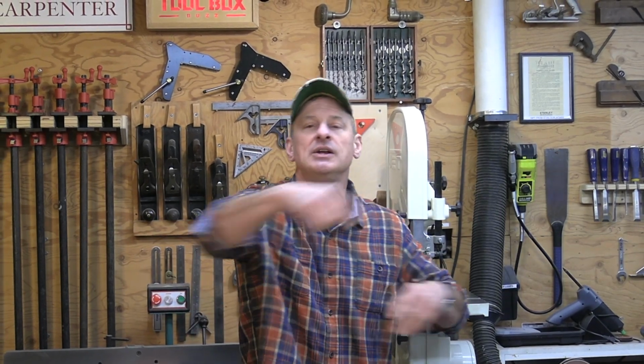My counter opening was not square, and had I not used a template and relied on my tape measure, it would not have been a good fit. One pro tip for you though: if you have a back wall that is really bowed or curved, I would deal with that first, and I would scribe my back piece first. Maybe use a wider piece of luan, scribe that, and then build my template to that.